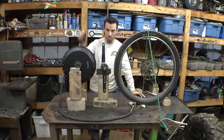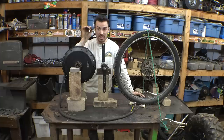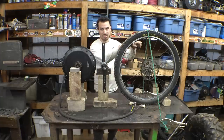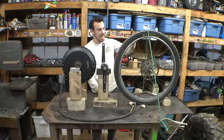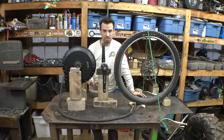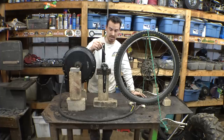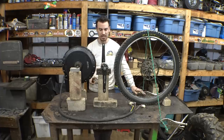That way the motor wouldn't be moving with the rear suspension, and we can reuse the swing arm off the mountain bike, so therefore we don't have to remake the dropout points, we don't have to remake mounts for the brakes, the gear selector and everything. We can kind of just use all that stuff off the swing arm, and we don't have to make a new swing arm from scratch. All we really got to do is just figure out how we're connecting it to this, which isn't that hard. It uses bearings. That's super easy to copy.